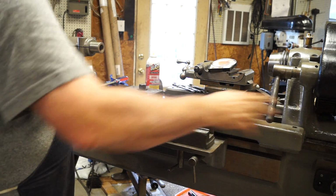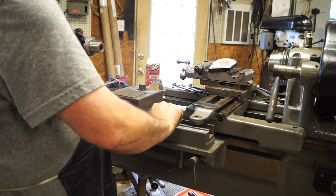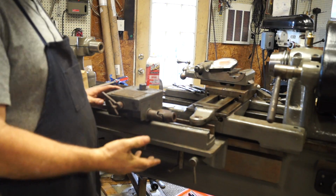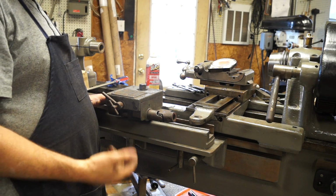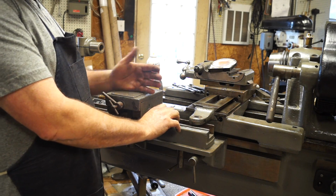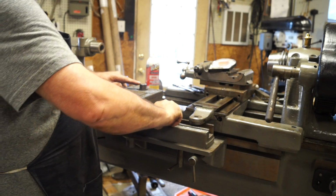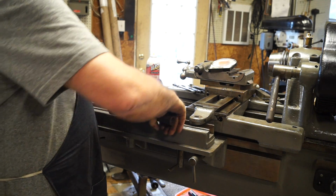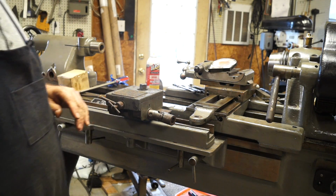And as that shaft will come in, like I said, from over there, it rotates on a gear system just like a thread. It's basically the same setup as threading. It's just that instead of timing a thread, you're timing a relief. And as it turns, if you watch this little arm here, it moves in and out, okay? And so that gives you your relief in your part.